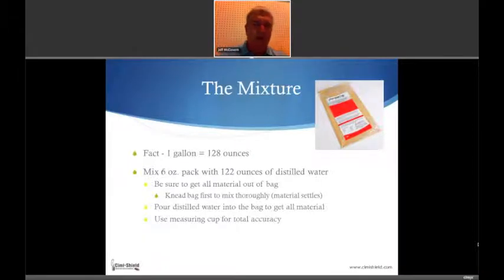If I'm rinsing my sprayer afterwards, I pour a little distilled water in it, pump it up, squirt it out so my hoses are clean, and I don't use anything else to clean that sprayer. That's been something I've done with this for a long time. My main sprayer for this, I'd gotten through Univar, a stainless steel tank, and I've only cleaned it with distilled water in the year and a half that I've had it for this product. Any other questions right now?